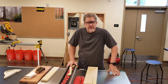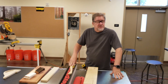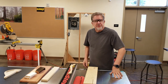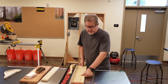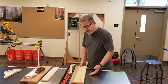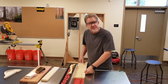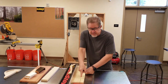The second major hazard is don't let your fingers come in contact with the blade. I see students with their finger lined up with the blade, moving their hand towards the saw blade — never move your hand towards the blade on any machine. My hand should be back out of the way and not lined up with the saw blade. As I'm cutting something, I'm going to leave my hand in one place to hold it down on the table and tight against the fence, and slide the material underneath it so my hand is not moving towards the blade.